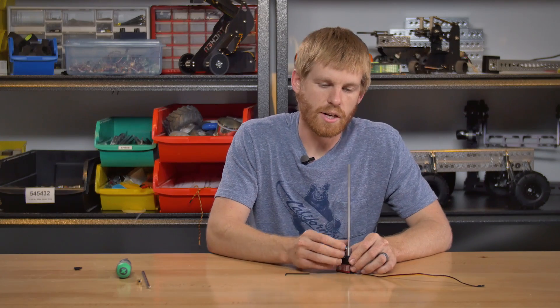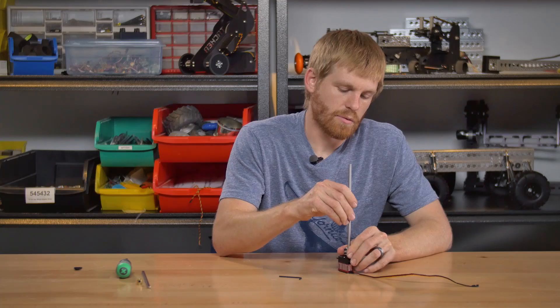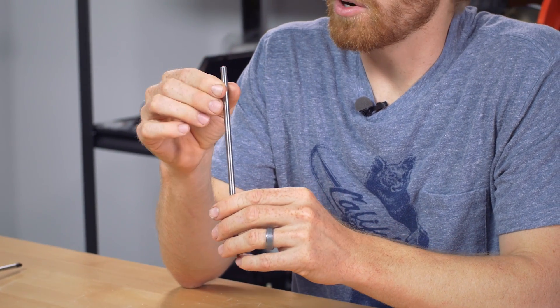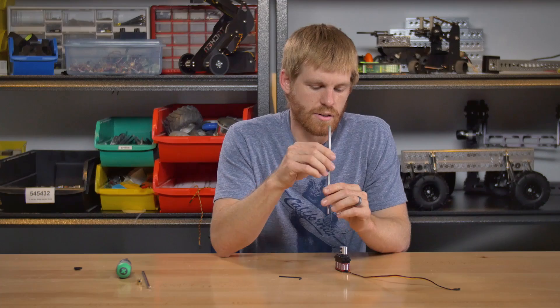So a really great product. If you get it in there and realize you're two degrees off or something like that, you just loosen the two pinch bolts, rotate it a little bit, tighten them back up and you're done. The other nice thing is if you want to reuse that shaft on another project, it's not going to be marred up at all — it's not going to have any marks from a set screw or anything.